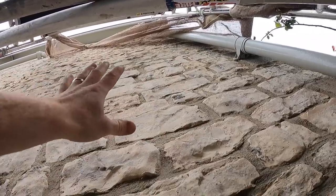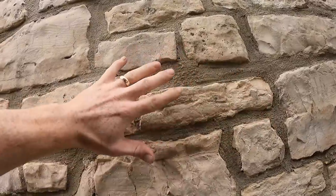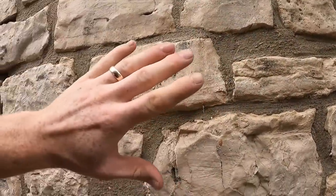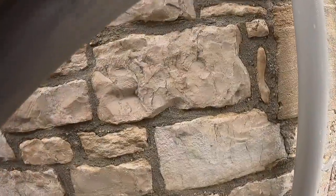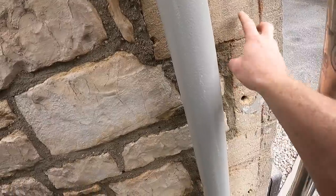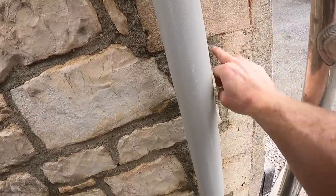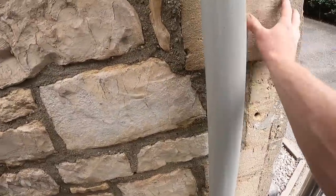That's damp, that hessian that's hanging all the way down, covering all this, trying to keep it away from the sun, nice and damp. We want, the slower the better really, as far as the lime goes. One area we're spotting is drying much quicker is next to the quoins, so these cornerstones, for some reason, are drawing the moisture out more, so we're trying to keep these nice and damp.